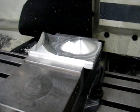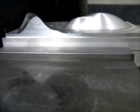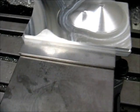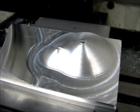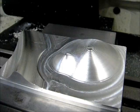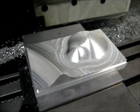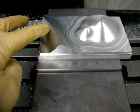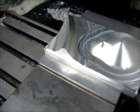There's the finished part. Here's the ridge — get an idea of the profile there. And then here's the dome, and then the secondary dome off to the side. That's the whole thing. With that 20-thousandth depth of cut there was no burr at all. It looks like there's a little bit of a rough finish right in the area where it's probably at 45 degrees — just like the chamfer on the nose of the tool — so it cuts a little differently there, but for the most part that's about right.